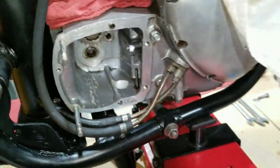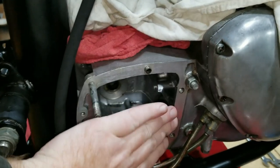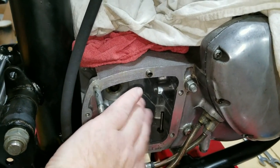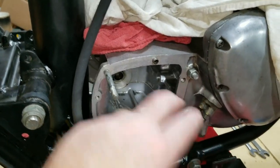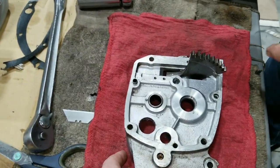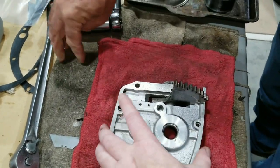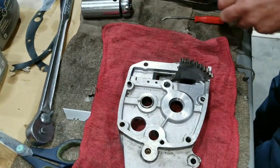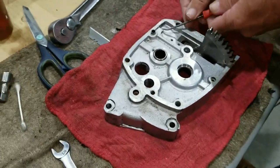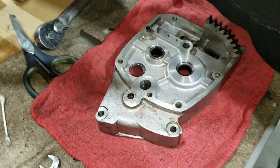We have the intermediate door cover, which has the other bearings in it and the kicker parts are on the outer side — there are two pieces that go here. We got the one unit pretty much cleaned up. This is the bearing end. We had to install the shifting index springs, which were bent pretty bad when we took this apart, so we went and got new ones.